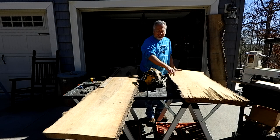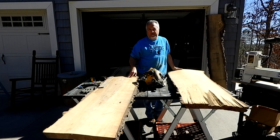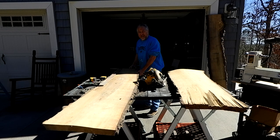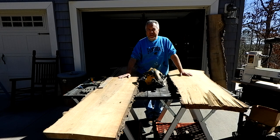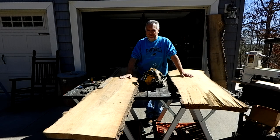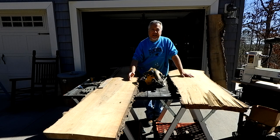This is the kind of slab I would probably reject and save for last when I'm almost out of wood, or I'll make a bench out of it — I make wood benches, I have them all over the property. This piece right here is a good one; you can see the end is pretty flat. That's important because when you cut it down on the table saw and make a dowel — which is the first step — it makes it easier. Making dowels is dangerous work because you drive the wood through a doweling jig with a powerful drill, and if it's warped it can get stuck and twist you around. This jig is the best, just a little temperamental, so you want the flattest piece of wood.